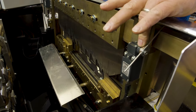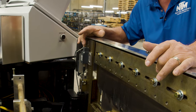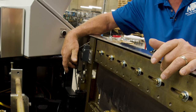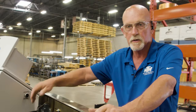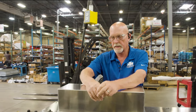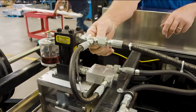This will be your right side top of stroke. This is the left side top of stroke, and right below it, over on this side — a lot of people have a problem finding this one — it is the bottom of stroke. When the shear goes down, if it stays down, we normally use this one to bring it back up. This machine has notching in it, so we're going to go ahead and show you the top of stroke here to allow the machine to run.